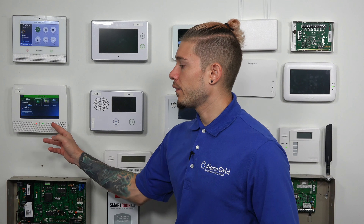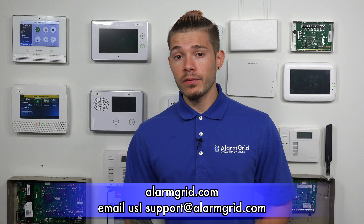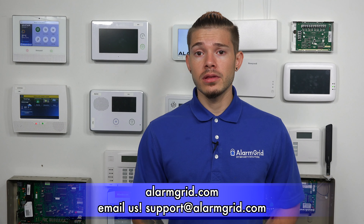One important feature I did want to touch on: the SmartThings hub is a Z-Wave Plus hub. If you're using any Z-Wave Plus devices with this normal Z-Wave L5210, you're going to be losing the features of the Z-Wave Plus devices. Usually, the Z-Wave Plus features are longer battery life and longer range. So if you learn in a Z-Wave Plus device with a normal Z-Wave controller, more often than not you lose the Z-Wave Plus feature. There is no Z-Wave Plus feature for the L5210 or any of the Honeywell panels at the moment — the L5210, the L7000, or the Lyric — it's all just normal Z-Wave. So keep that in mind whenever you're buying Z-Wave devices.